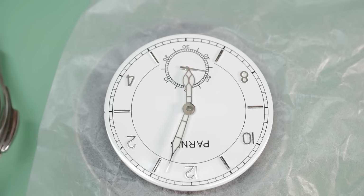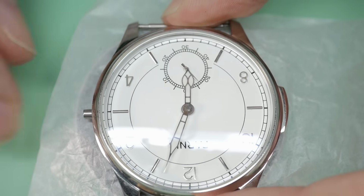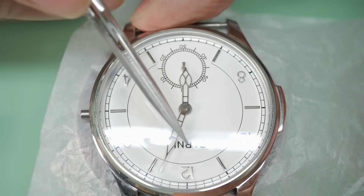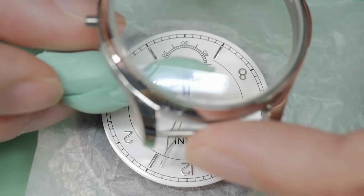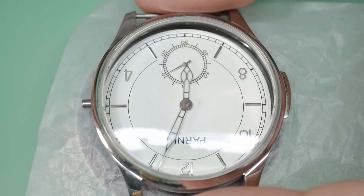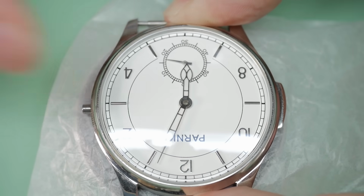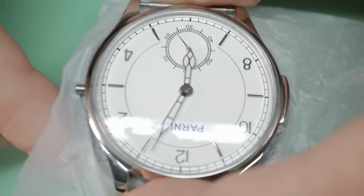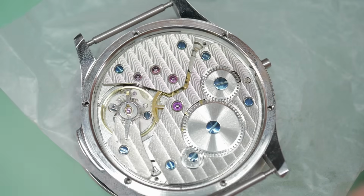And what we'll do is place the case over the movement, and we can check again if there are any more spots that we didn't notice before, and I can see one here. So I'm just going to use my Rodico, and there we go. Looking good. And the technique is once you've placed the case over the movement, lift the whole thing together and turn it upside down. And there we are. Everything is in position.